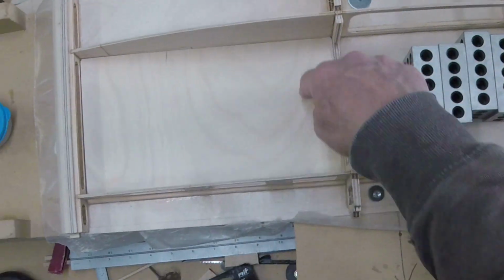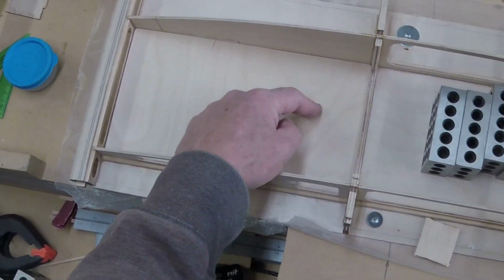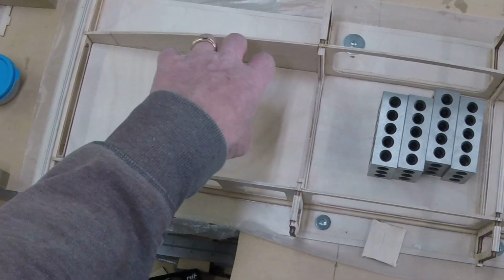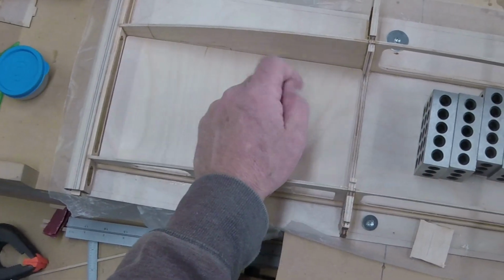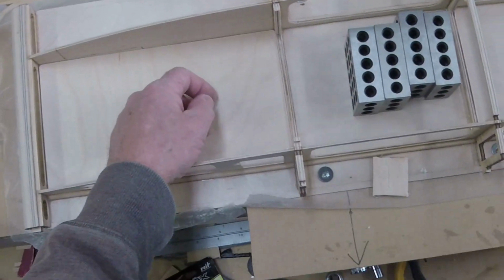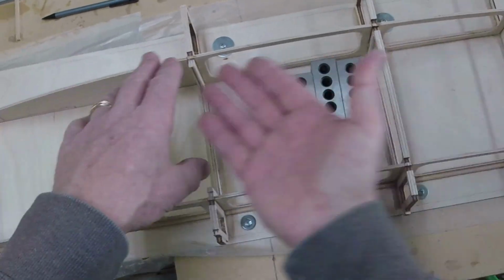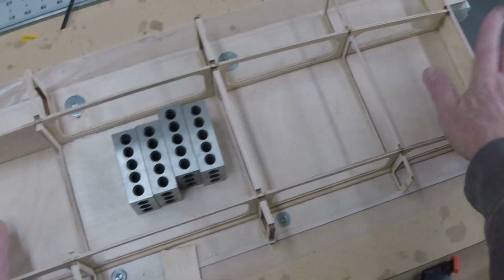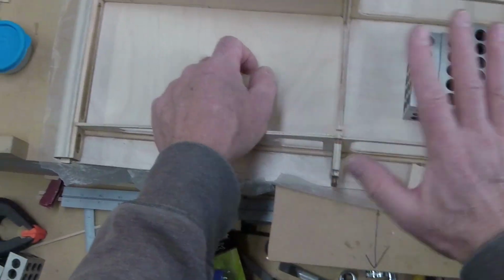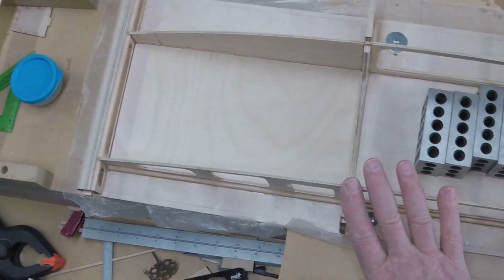And then we're going to come back and cut some of this out because we're going to put in an engine well. Oh, by the way, it's not mandatory. If you're doing an electric boat, you can have the motor up above. Especially if you run a cable drive system to the rear, the motor can be up, and then you just run the cable, with a little radius going back to your strut. We'll deal with all of that. Don't worry about it. I'm not building electric, but all of the principles there are the same.